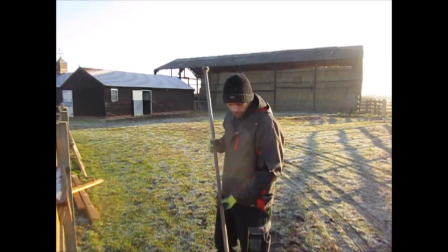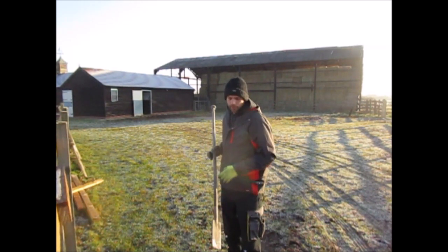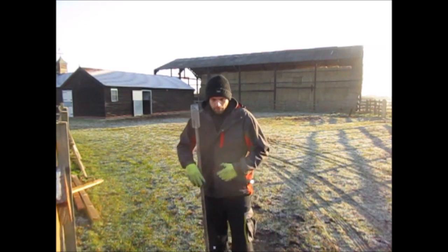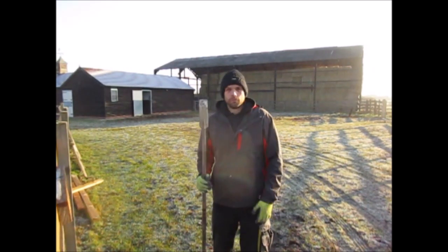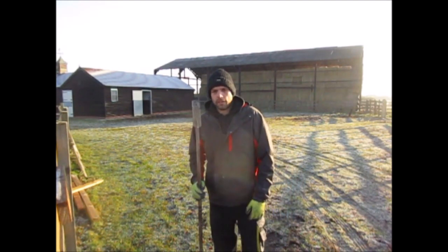Next is the manual breaker. It has a two-inch chisel head on one side and it's also a stomper — there's the knuckle I was talking about. Once you've got your post in the right place and filled around it with dry mix, you can stomp it down and pat it down to firm it up. The concrete will do the rest, but compacting it while you're moving on to the next section helps.